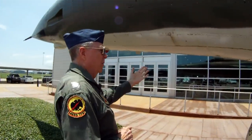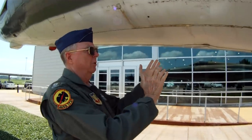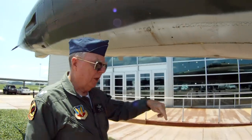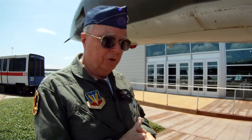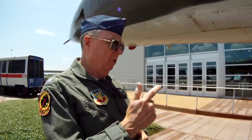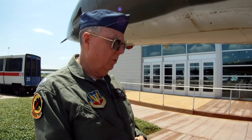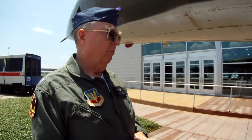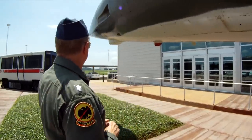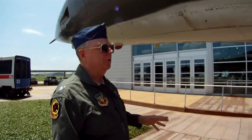Come down here — these would normally be open, but they've got them closed and disconnected so birds can't get in. There's one thing in here you always check on preflight: a little box with a safety switch for the armorers working on the gun. On one or two airplanes I know of, that door wasn't closed properly and it was missed on preflight. It jammed the nose gear up and the pilot landed with the two mains down and the nose gear up. All the airplane did was land on its nose and grind to a halt. They put a new radome on it, a new pitot boom, and it was good to go. Can't hurt this airplane.